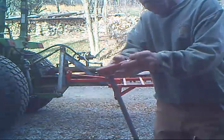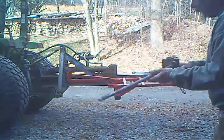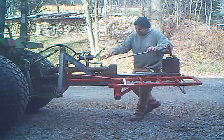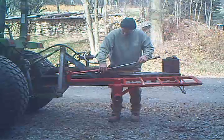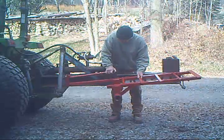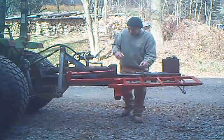The telescoping lift hinge plunger arm is a length of one half inch round stock with a tie coupler welded to the end. The plunger arm is inserted into the three quarter inch pipe receiver arm, and the tie coupler is connected to the splitting ram head.